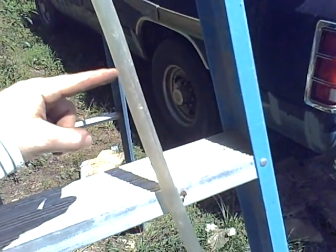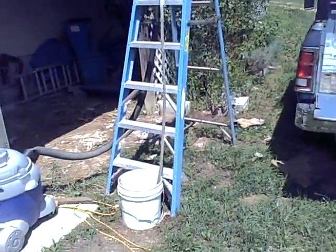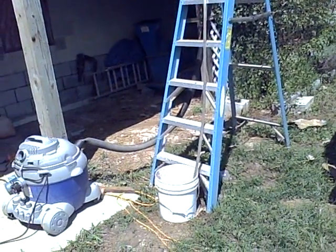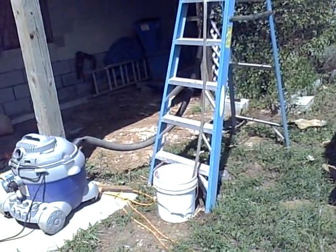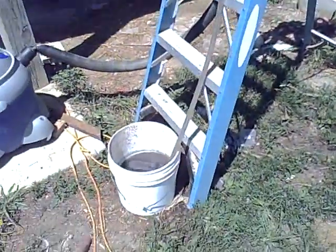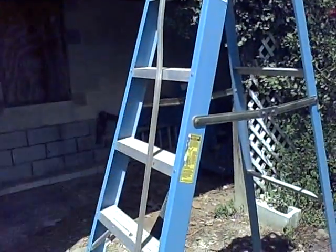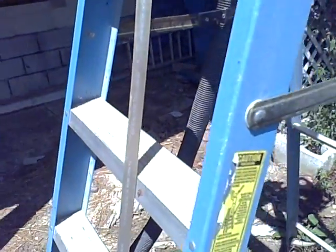This is the point right here. It's about halfway between these two rungs. So I would say that's about four feet, 48 inches of water column — maybe a little less, say 42 inches. You do have to count above the surface of the water to the point where the water column is. There it sits, steady — it's 45 inches of water column.